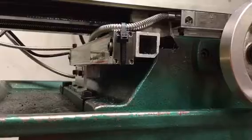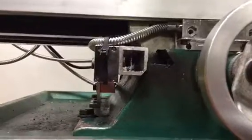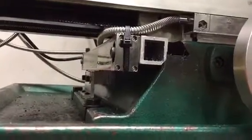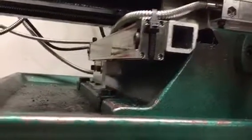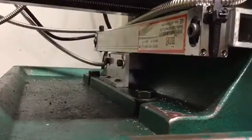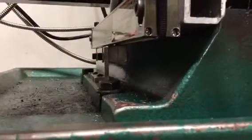For the y-axis I took a piece of one inch aluminum square tubing, had to machine a little slot in there so I'd have clearance to fit on the table. Then inside I had to drill and tap a couple screws into the cast iron — pretty easy to drill and tap. Bolted that to the frame of the mill, then bolted the scale to that, and the reader sits on the bottom. Had to drill two holes in the bottom to fasten the aluminum angle bracket — pretty simple.